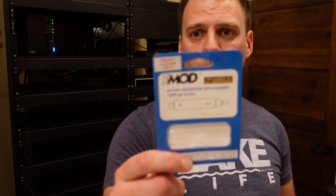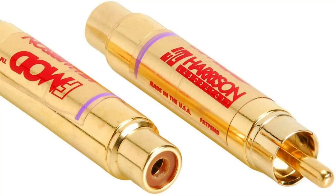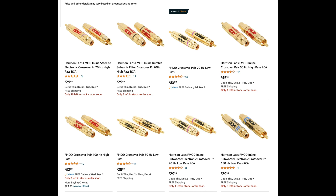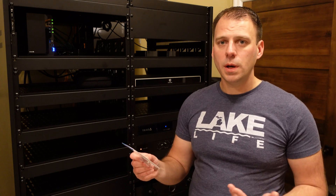Talking to both Triad customer technical support and my integrator friends, you can manage the crossovers with an external unit. This is a Harrison Labs FMOD active crossover — a couple-inch-long cylinder that functions as an inline crossover. The RCA outs of the last subwoofer Rack Amp go through this crossover and into the amplifier that runs the mains. These come in many varieties — available on Amazon for about $20 to $30 depending on the seller. They offer both low-pass and high-pass versions, at frequency ranges from 50 all the way up to 6,500 hertz.